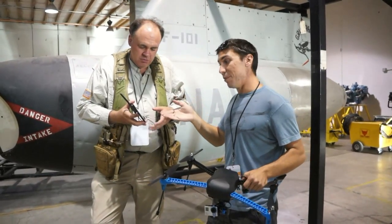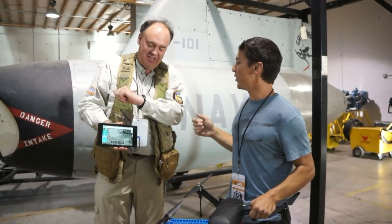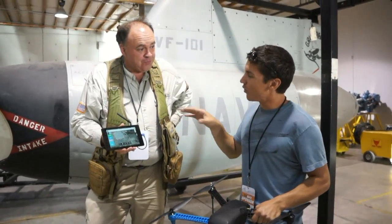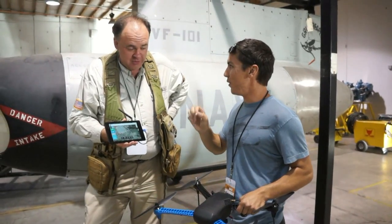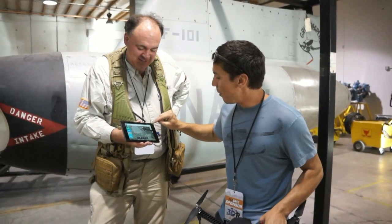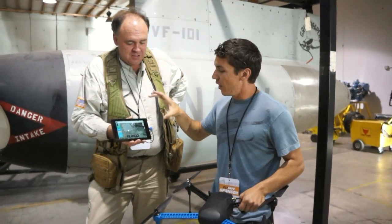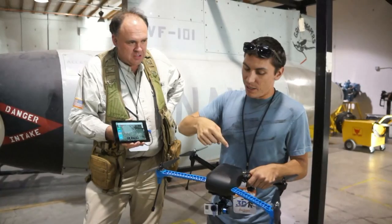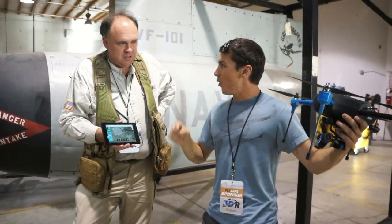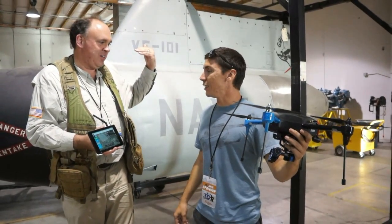This will work on a phone, tablets — I've even seen somebody using a watch, which is pretty cool. The other thing that's really new and exciting that we've co-released with the Iris Plus is the follow-me feature, which they're calling 3PV now. You hit one button and the aircraft uses the GPS location of this unit, transmitting up to the aircraft to give it an offset. So if you move while in follow mode, it's just going to trail behind you. You can tell it: get 200 feet behind me and 50 feet above me.